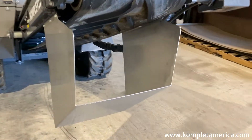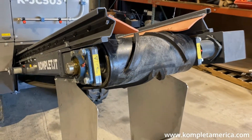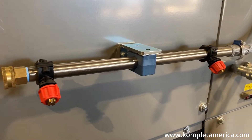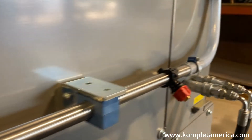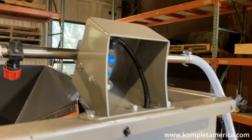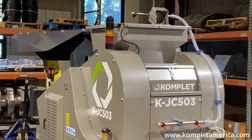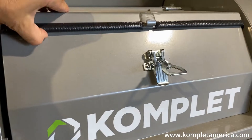This KJC 503 unit is equipped with the magnetic roller add-on option that allows for metal to be separated from the end product and discarded under the belt. Above the extraction belt is the dust suppression system that can be attached to a garden hose, which will spray a mist of water onto the extraction belt as well as into the jaw crusher inlet opening. The light on top flashes yellow when the machine is on and red when the machine is moving, and on the front of the machine there is a compartment where you can store supplies.